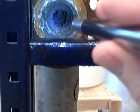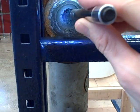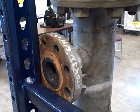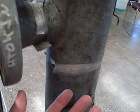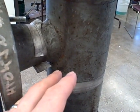You can see a bit of it up here as well. This is really crudded up with a bunch of sulfide crystals, so it's pretty hard to see what's going on. But the displacer height extends between this point up here and that point down there, with the center being right about there. As the liquid level builds up, the displacer experiences a larger and larger buoyant force, which makes it seem as though it's getting lighter.